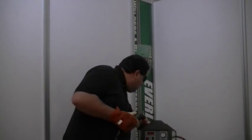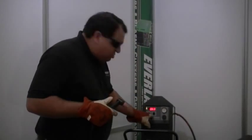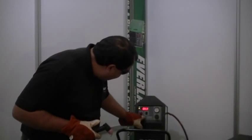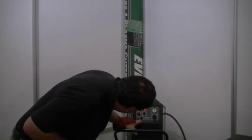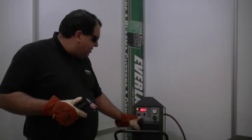I'm going to start the machine. I'll reach around back and flip the machine on, then check my air pressure under flow. You want about 60 to 70 PSI — I'll sit right at 70 PSI.